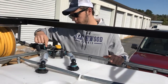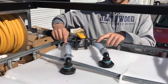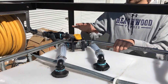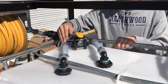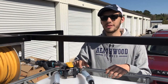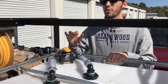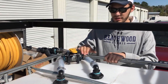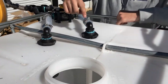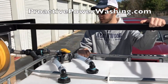Coming out of this three-way valve we have pipe thread to hose barb elbow valves. All of these that go into Banjo products — we found we also like to use the Banjo valves. They fit the threading a lot better and give you a tighter seal even with the pipe compound in there. It makes a world of difference, prevents leaking, and is definitely worth the investment. Then this just goes into a one-inch bulkhead on the back end on both sides that run down into our tank to fit on those Hudson valves we already showed you.